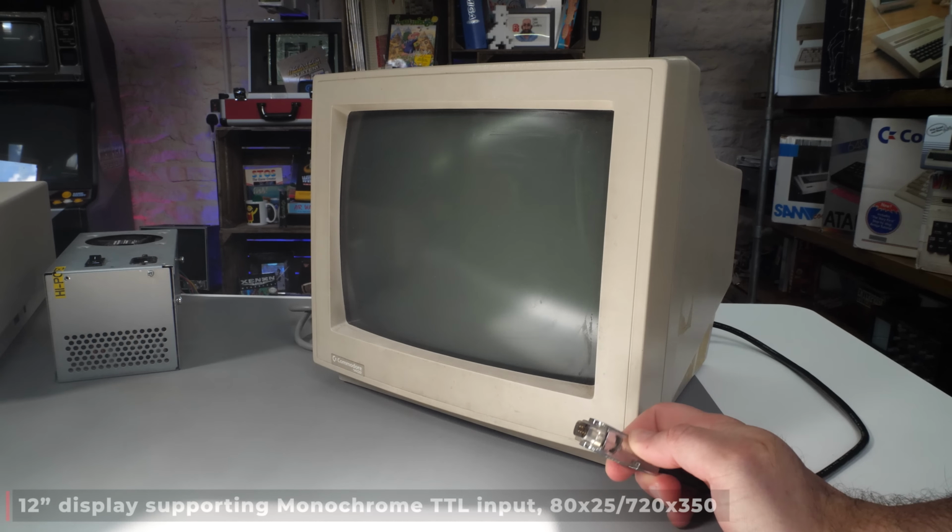It's a nice, easy system to work in. There's our floppy and hard drive shelf going back into place there. And then our power supply can also go on that shelf, which we did test, I'm pretty sure, in the first episode, but I checked it again and it's still putting out the right voltages, so that's safe to use. And then one sticking point could be the fact that this PC uses XTA rather than an IDE hard disk interface, meaning modern replacement is a little bit trickier to find, so I've got something to help us with that.